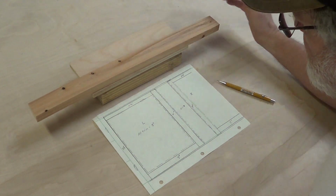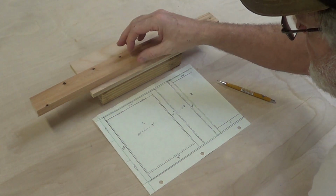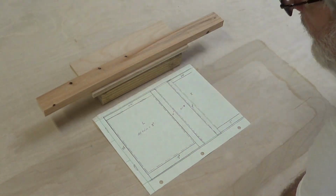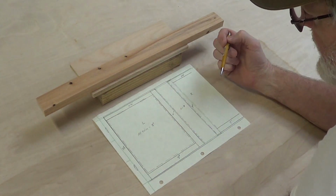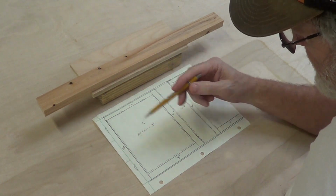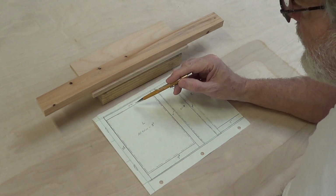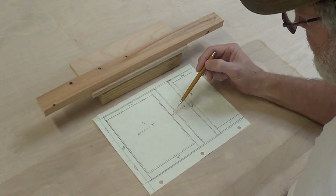Now the trim, sometimes will be flush, sometimes will be set back if a door closes against it, and sometimes will overhang if it's closing up against the structure as the stop. Okay, so with that, the other thing is I want the trim on the outside to all be 3 inches wide. I don't want it to be varying widths. I want it to be uniform. So with all that, I think what I got to do is make the framing part, the 2x4 part, different widths. So 2.5, 3, 3.5, 4.